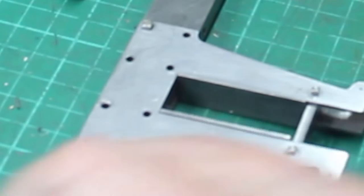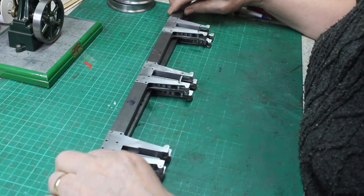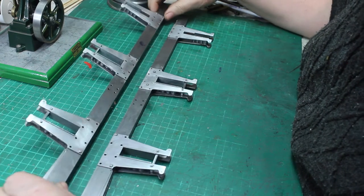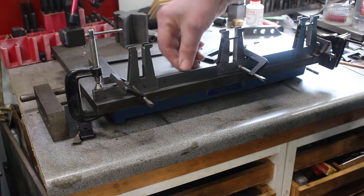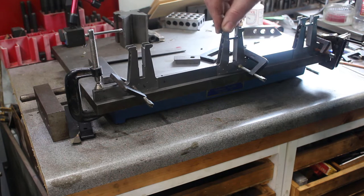So we'll take a little step back in time and I'll show you how I went about getting these horn plates in place and getting one lined up with the other. We're ready now to attach the horn plates to the frame. I've got them clamped in the correct place — I've measured up the correct position. So I'm going to do my usual trick: I'm going to glue these in place so that they can be held in the correct position for drilling for the rivets later on.